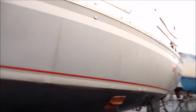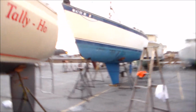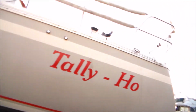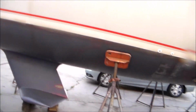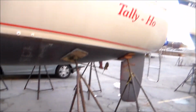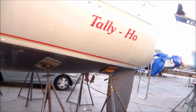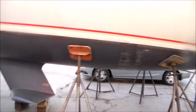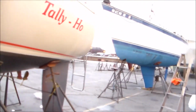The last mechanical thing that we didn't get done tonight was to, I think we need to adjust the engine mounts a little bit, the alignment's off for the shaft. And I haven't tightened the transmission bolts because of that. So on another day, maybe with some help, we'll try to figure out what to do to adjust the engine mounts and alignment a little bit. At least get it close. Since we're not in the water, it's not gonna stay quite like it is. Or we tighten up the bolts and then realign it once we get in the water. I'm not quite sure what we're gonna do yet, but I'll make myself a note not to start the engine until we tighten up those transmission bolts.